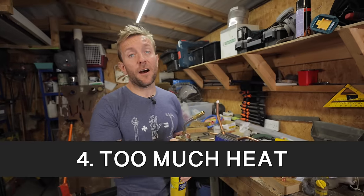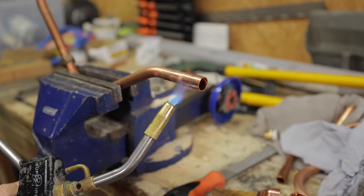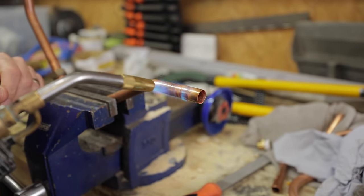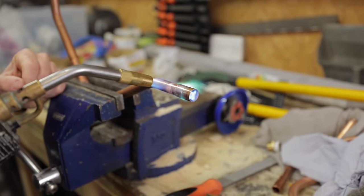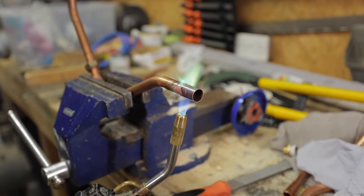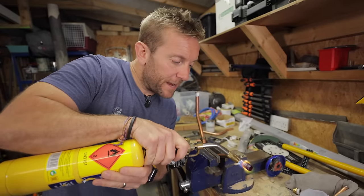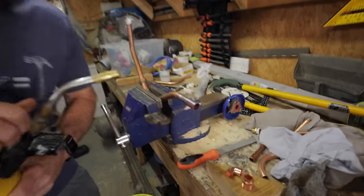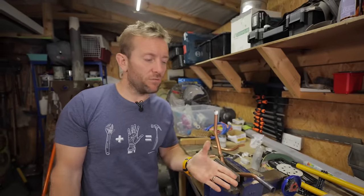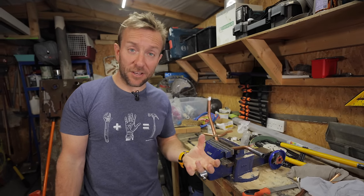So you can put it on here and get that fitting going — look at it, it's all insane, everything's too much. We're heating the fitting up nicely at the moment, but now that's getting to a point where it's too hot. The fitting is getting too warm and we're putting too much heat on it. You can see the fitting is actually going blue. When it's gone a bluey colour like that, you've fatally weakened the metal of the fitting and the pipe — you've structurally changed it. It's got too hot and over time it could leak.